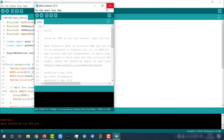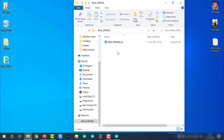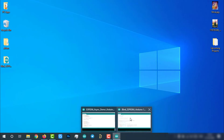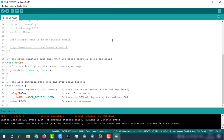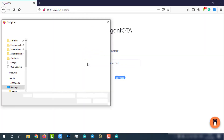I would like to upload a blink sketch to the ESP8266 using the OTA option. As explained, we have to use .bin files of the firmware when sending to the ESP8266 module. First, convert your code to a binary file in Arduino — you can do this very easily using the export compiled binary option. Then select the binary file from the web page and it will automatically upload to the ESP8266 module over OTA.